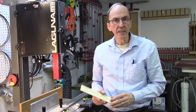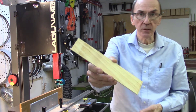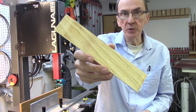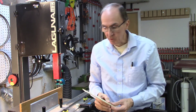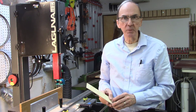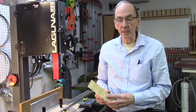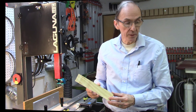One additional thought: if after sawing you start to see some burn marks or shadow marks on your wood being cut, what that tells you is your blade is dull on your bandsaw — it's time to change the blade. At this recent trade show, after about 10 hours of cutting and cutting hundreds of pieces of wood, we started to see this shadowing. I changed the blade and the problem went away. The blade was sharper and took care of it and cleaned it right up.